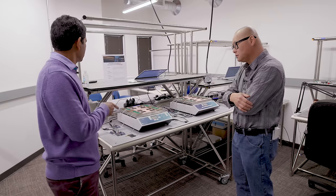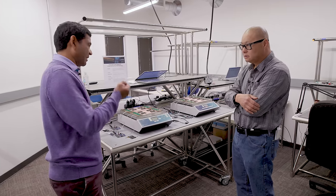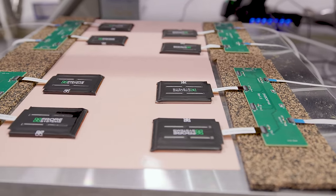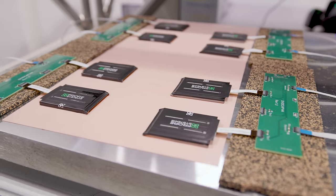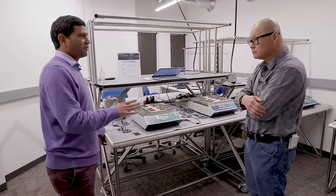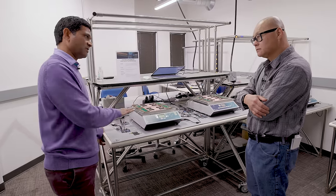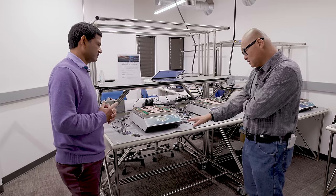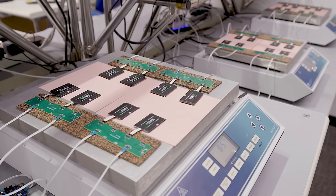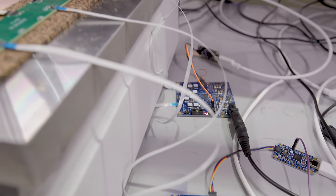This is another reliability test — a long lifetime test. We run the Airjet for 2,000 hours continuously, which is about three months of continuous operation, and make sure performance has degraded less than five percent after 2,000 hours — true of 100% of devices. These look like scales but they're actually hot plates. We emulate the Airjet inside a notebook by placing it on a hot plate at 85°C, essentially the typical die temperature, running at 100% operation non-stop for 2,000 hours.